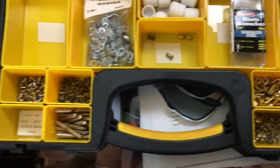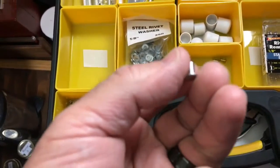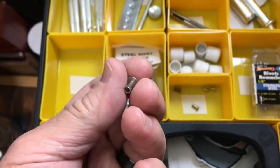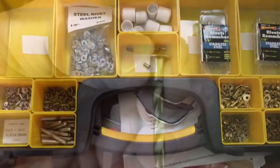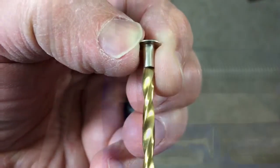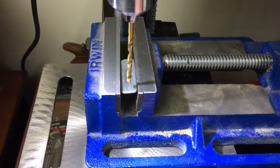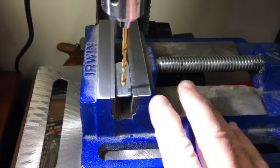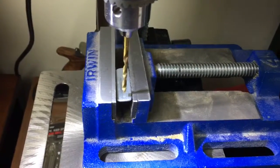I have a bunch of different types of rivets and I'll see what works. This one is designed for leatherwork — let's see if I can put that in and flare the end out on the back side, which should give it a nice flat profile. I have the small metal piece chucked up in a vise because it's such a small piece — don't try to hold it by hand, it could spin loose and really hurt you. I'm using oil to make sure the drill bit doesn't get too hot and lose its temper.